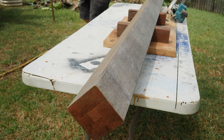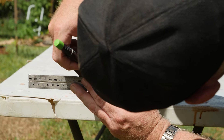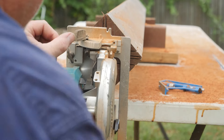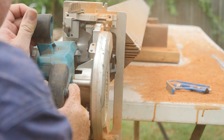So I picked up this solid Merbau post off Facebook Marketplace and set about trying to cut in a recess that I could attach the cross piece — the mounting piece that the lantern will sit on. I used the circular saw first and then a chisel to cut away the pieces.